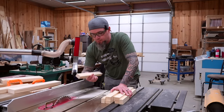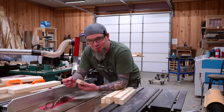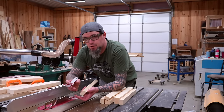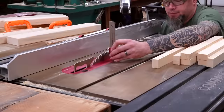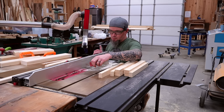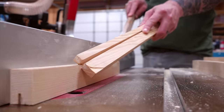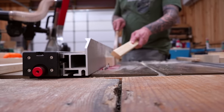With our top and bottom panel boards cut — I'll call them PV boards for short — now we need to cut a notch for our slats to fit in. Since our slats are a quarter inch thick, we'll cut a quarter inch notch in the very center of the board. I'll lower my blade to a half inch depth and set the fence to five eighths of an inch. This takes three passes: first pass, then flip the board and make a second pass, then a final center pass. I'll make sure to cut each slat at 13 inches, giving a half inch support on each side with 12 inches exposed.